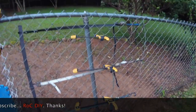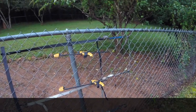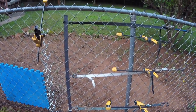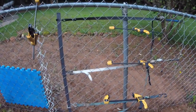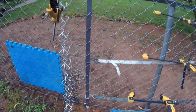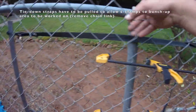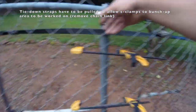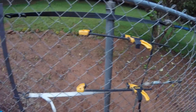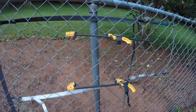Change of plan. I originally had the tie-down straps directly on the chain link, knowing that it would probably mangle or disfigure the squares. So what I did is put some flat bar on both sides — unfortunately I didn't have the same kind for both sides. The bars are in there and now I'm using C-clamps, which allow me to compress the section I'm removing by pulling it in, and hopefully give me enough room to weave those links out, take that piece out, and put the new piece in.